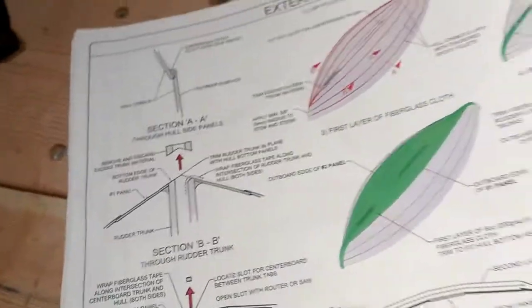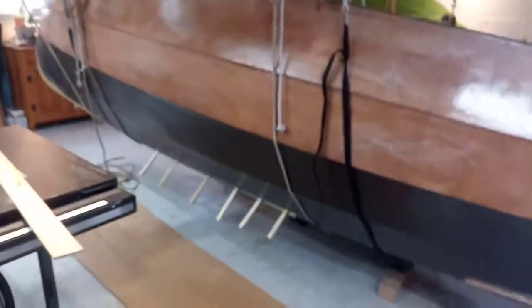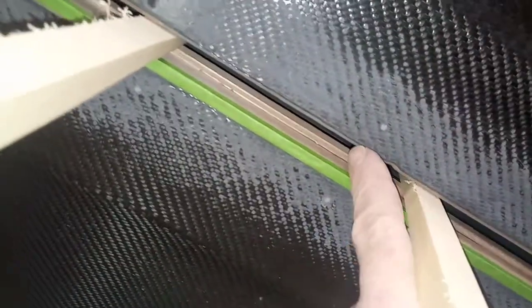To do that, I've lifted the boat up on the pulley system and tilted it so I could get underneath. I used a router with an edge-cutting bit with a little bearing on it. I had pre-drilled holes through here so I knew where the centerboard was before I put the centerboard trunk in. I ran the router bit through one of those holes up and down the inside, then put a quarter-round bit on and rounded that edge over.